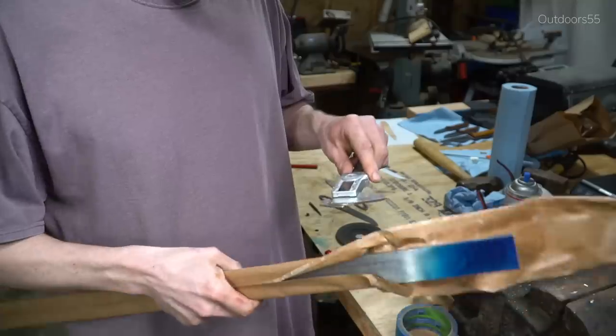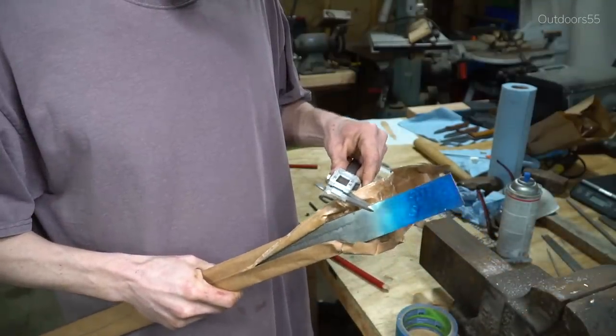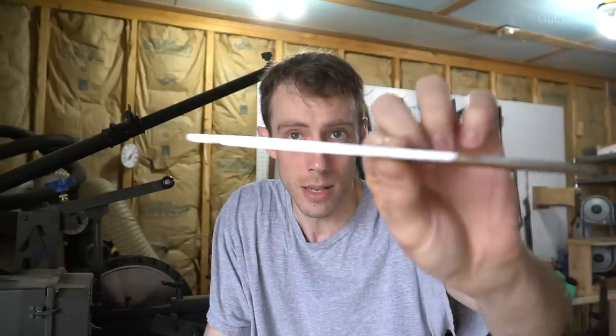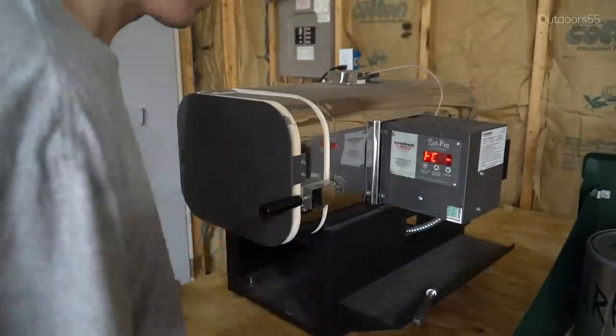I already ran into a problem with the thickness of the material - I cannot find S7 in a thinner stock thickness than about 145 thousandths. However, I still think this blade might make a really good lightweight knife simply because look at all of that spine thickness we still have on there. This should have absolutely no problem standing up to the abusive testing we put it through today. This takes a while to heat treat, so I'm gonna get this thing in the oven, get it heat treated, and then we'll do some destructive testing.